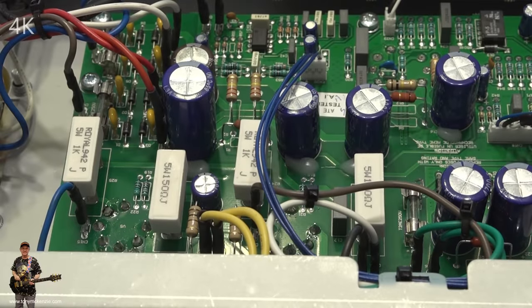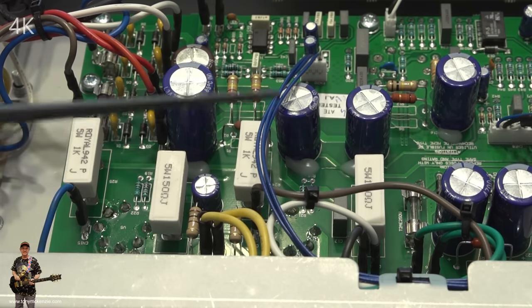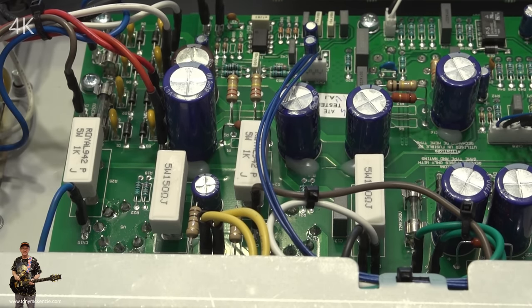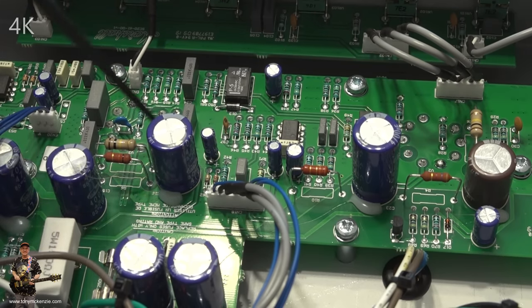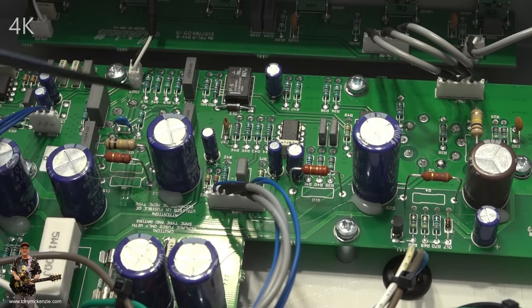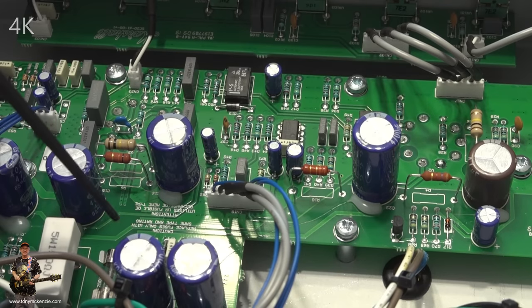Actually, just looking underneath the board, that's a power tube, and so's this one at the side. These are power tube sections. The preamp's further down the board that way. So let's move that way a bit further, more into the actual preamp section. Okay, well, this little bit here, it's sort of hidden behind that, but you can see there's a sort of preamp tube there. And this is the PI tube, you know, the balancing tube. Here it is. We're going from the power amp down there, now to this balancing tube that is in this area of the circuit. Notice there's a fuse right there. So that's three fuses up to now.